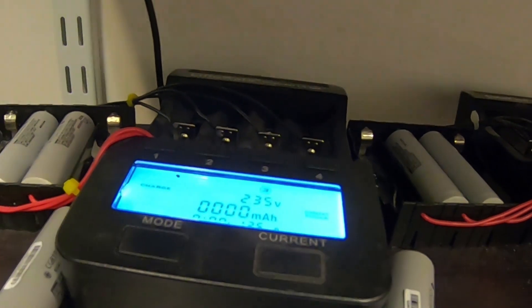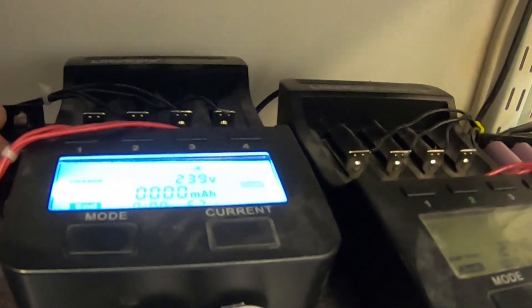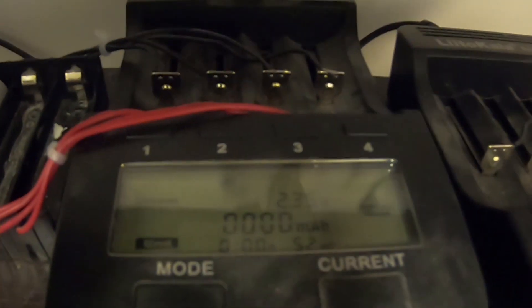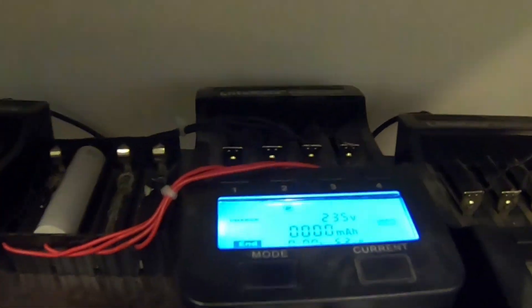The other Litokala will figure out the chemistry, and at 2.2–2.3 volts it will recognize this as a heavily discharged lithium-ion cell and charge it all the way up. At 2.39 volts, let's move it into a charging slot. The reason I'm using this separate unit is that I test used cells here, and sometimes they leak electrolyte. If that happens in the channels of the Litokala Li-500, the Li-500 will be destroyed internally. I'd rather have them leak in these easy-to-replace slots — this costs about one dollar, while the charger costs a lot more.